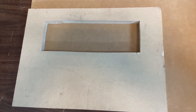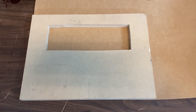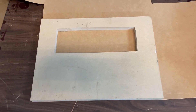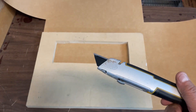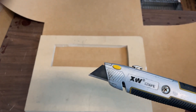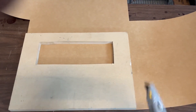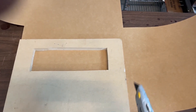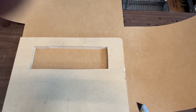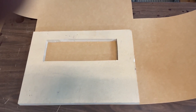You want to do the backside because it's much better to cut on the backside — you don't get that fragmenting. All you need is a razor knife like this with a brand new blade. The idea is not to cut through on one cut, especially on the cross cut. You want to keep scoring it; it probably takes about four passes on the cross cut and maybe two to three maximum on the with-the-grain cut.